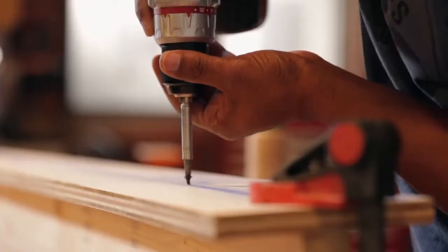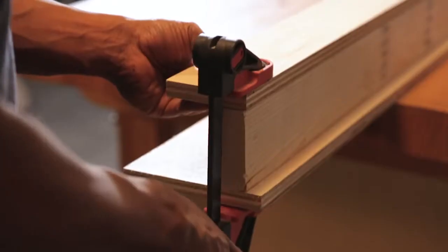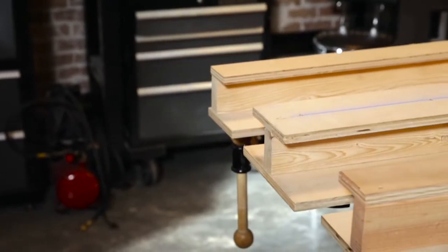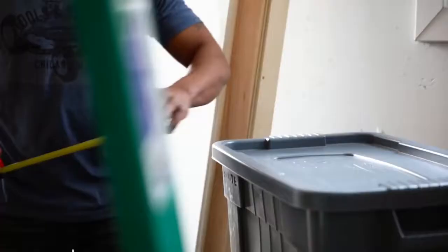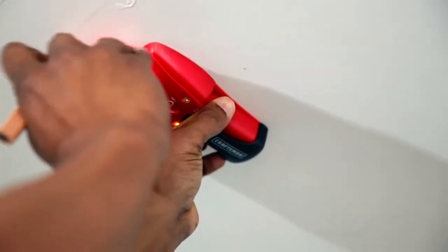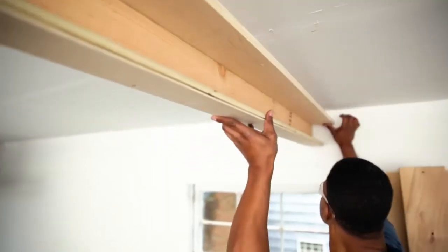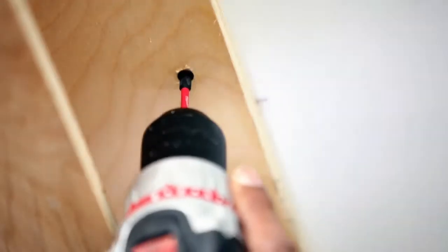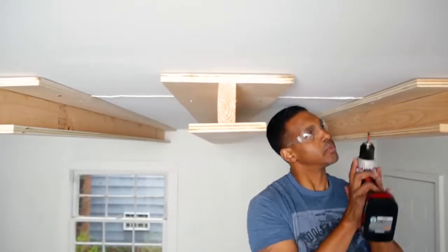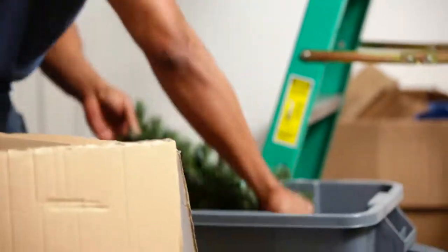Each beam is made up of a 2x4 with cuts of plywood attached to the top and bottom. The middle beam will have a letter I shape, and the two outer beams will be shaped like the letter C. The key is to space your beams the width of the storage containers. Find joists in the ceiling, mark your layout, and screw in the beams. You want the lip of the container to sit flush on the bottom plate. This will allow the container to slide in and hang securely. Only thing left to do is put your stuff into the bins and then slide them into position.